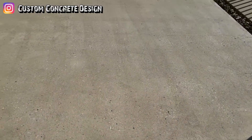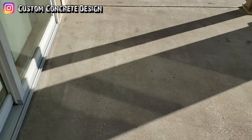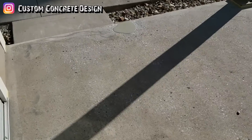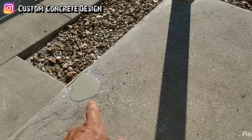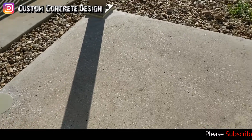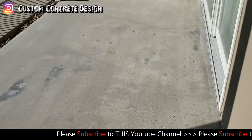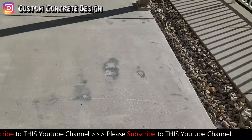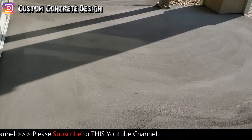We have all the overlay off of this deck right now. We have one area that we've patched up here just recently and we're waiting for that to dry up — we're going to grind it flush. There used to be a post there, so we filled all that in. Our cracks are filled and ready to go. Concrete is just ready for its overlay, so we're going to put a base coat of concrete on it today. Looking pretty good, nice and clean.